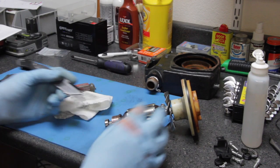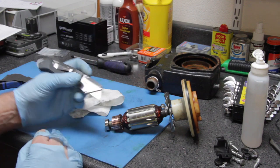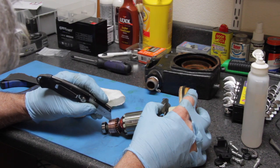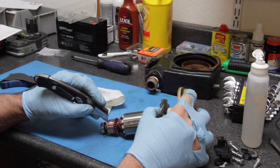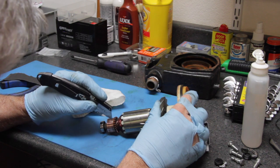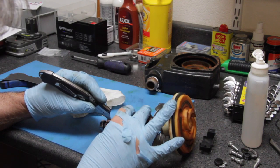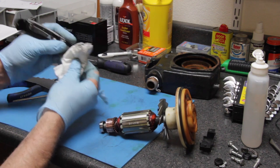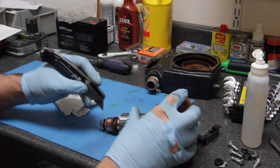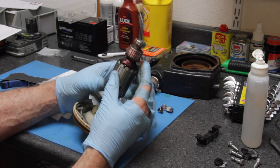After you do the sanding and wiping it down with acetone, get yourself a box cutter knife with one of the box blades. Very gently, you'll notice there are grooves on that — very gently go through, and if you look at the tip of the blade, because we've sanded on there, you'll see some crud build up on that knife blade. We want to go across and go through every single little slot in between the contacts on the commutator to get all that crud that we've sanded off.